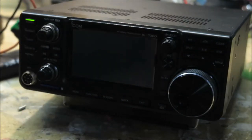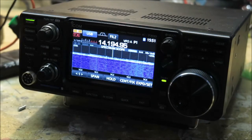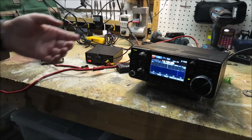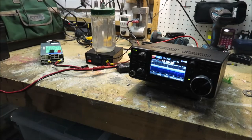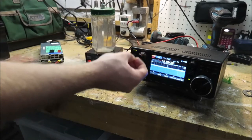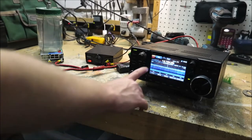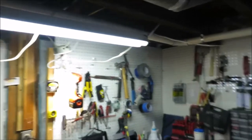Switching back to the Radio Shack power supply, it's quite a bit more noisy, but it still can't hold a candle to the battery. To confirm these power supplies are the source of the noise, I placed the dummy load on top of them while unloaded — there's a monstrosity of noise, almost S3 on the HP one and S1 on the Radio Shack. But does this mean the server supply is absolute garbage? I don't think so — our dummy loads are really close to the supplies, and we're also near blinking fluorescent lights, chargers, refrigerators, HVAC, a dehumidifier, and a running dishwasher.